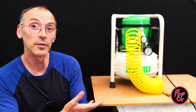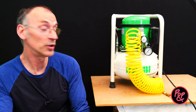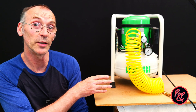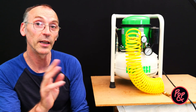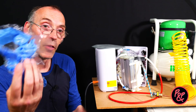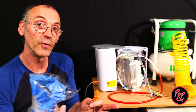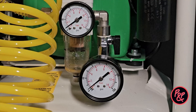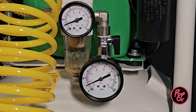We're going to use a Bambi air compressor capable of producing eight bar of pressure. We'll connect this up to the oxygen concentrator filled with carbon molecular sieve to see if we can produce a nitrogenous airstream that will extinguish a flame. We've got the bag to collect the gas, and we're aiming for eight bar pressure in the compressor tank — though by the time the compressed air is delivered to the molecular sieve tower it should be much less, say about five bar.